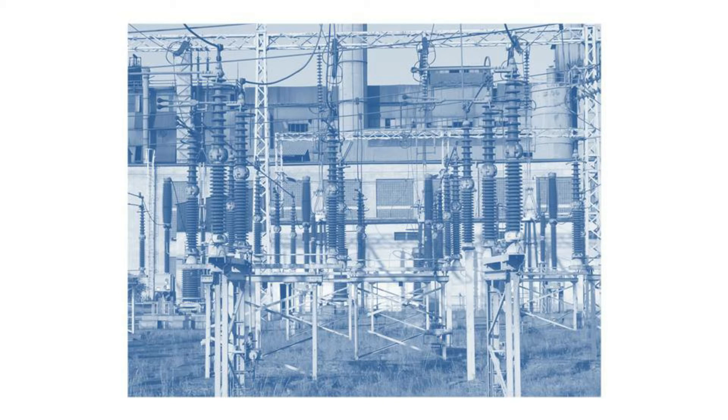In normal circumstances, we seldomly de-energize the entire substation. For example, in routine maintenance, we will only de-energize the specific part where the crews need to do maintenance. The reason being is that the load served must need to remain in service. Due to the contingency policies that most utilities require, it would be very difficult to schedule a complete substation shutdown for maintenance.